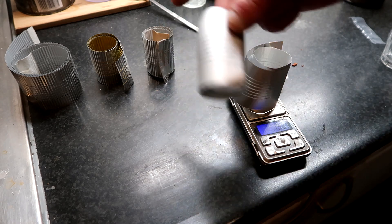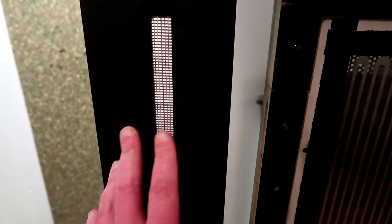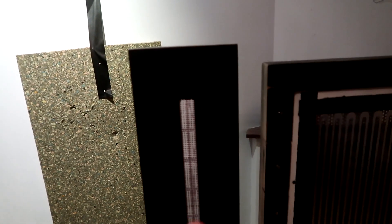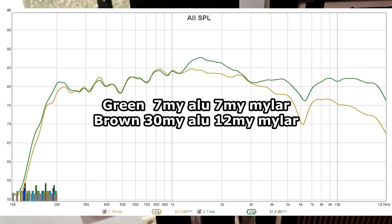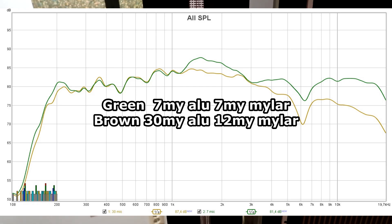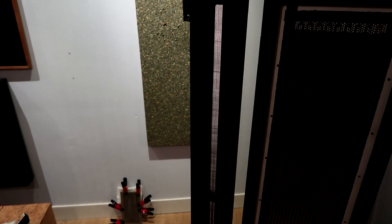I'll definitely try it, and if not then I can try the one above that which I did not try yet. So I replaced the ribbons — at least the top side of both loudspeakers. This is the 7 micron thingy. I forgot the weight but I did both sides, only the top side. I'll show you a measurement of the difference between the heaviest one and the lightest one — now that might be an extreme example. But even with the other foils, I made this contraption, had a listen and it didn't sound nice, or at least not as I'm used to.